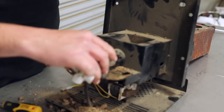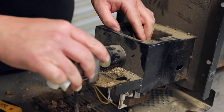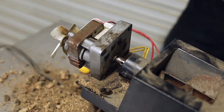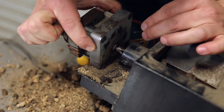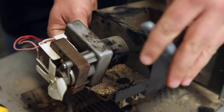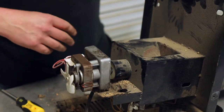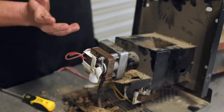Go ahead and get your auger motor, stick it back on your shaft, line up the holes, and go ahead and get your pin back in. Get that started, and then use your grippers to hold it. Now we've cleared out that auger shaft of all the debris, we've reattached our auger motor, and this thing's ready to go back on the barbecue and should work like new again.